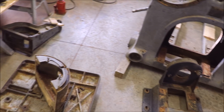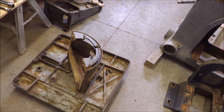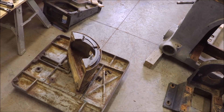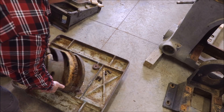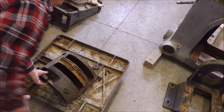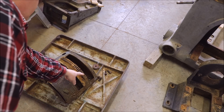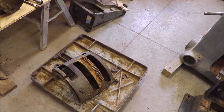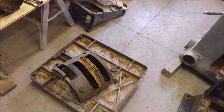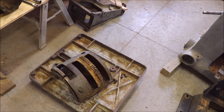That big half-moon shaped item is the gigantic trunnion, which gets mounted to the bottom of the table, and that's what gets driven by the rack and pinion. You can see there's a rack right here which is what allows that table to tilt. The table is all taken apart and it's going to the grinder - I'm going to have that ground flat, and then I'm going to hand scrape it because I like that finish. So we're going to make this thing as fancy and flat as we possibly can.